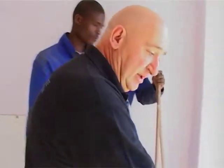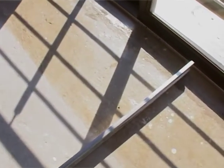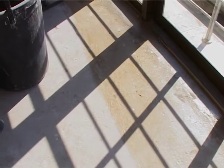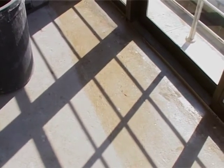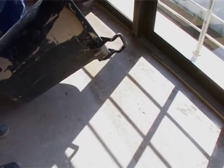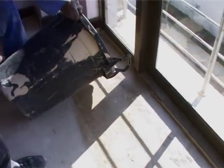By the door here was a little bit of a dip. We checked that with our straight edge, as you can see it here. Now we put our bonding liquid on the floor, and now the primer's there. Now we're going to just quickly self-level this little patch, this little area only. And then we can also start laying in this room in the morning. So there we go, just this little area to get it all straight.